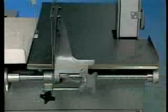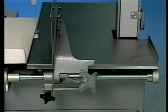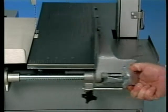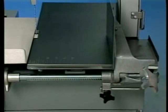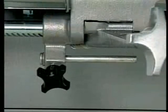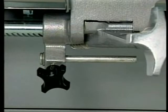If the gauge plate is not needed and interferes with work, it may be moved out of the way. Lift the adjusting knob, disengaging the teeth, and slide the gauge plate to the rear of the machine, or raise the gauge plate to a vertical position and slide to a convenient position. The adjustable gauging pin permits you to slide the gauge plate out of the way and then back to the original setting at a later time.